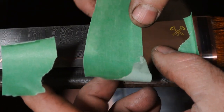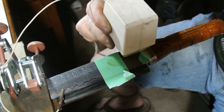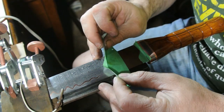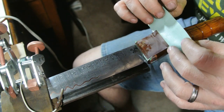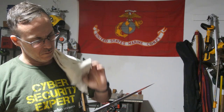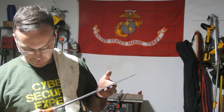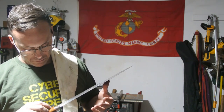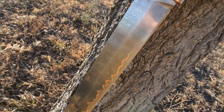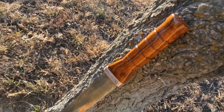Now I'm putting on the stencil for my Maker's Mark. I use a little electric etching machine — got it on Amazon, it's not super expensive, and the results actually are pretty good. Now a little final cleanup and admiration, just making sure that it's got no blemishes. I put a little carnauba wax on the outside to just kind of seal it a little bit, and it actually gives it a nice shine. And there you have it. I really like how the pattern in the Damascus and the striations from the copper came out. The handle came out amazing — I was really happy with that.